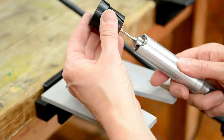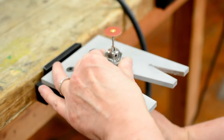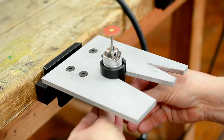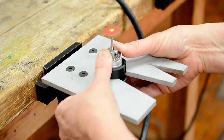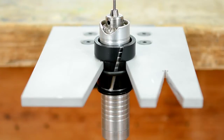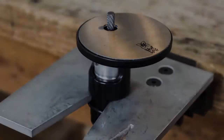Trace the small end of a Wolf flex shaft adapter collar for GRS and saw out a hole in the aluminum bench pin to fit. You can then slide the collar onto a number 30 flex shaft handpiece and secure it with O-rings. This modification will also work with the Wolf wax trimmer, which I use to mill hard plastic for jigs.